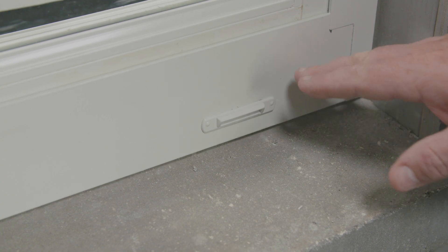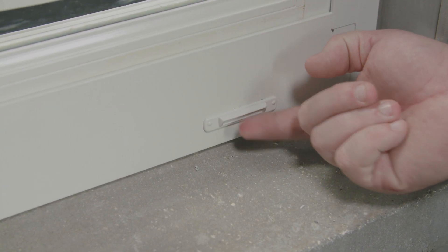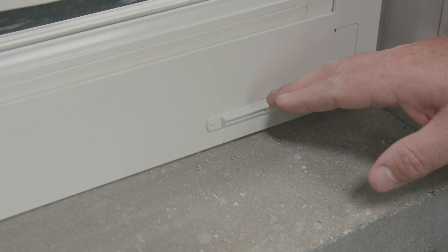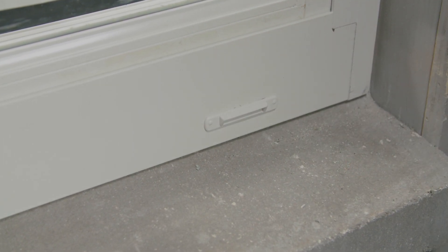The first service we're going to talk about is water not draining out of the sill. Look at your weep holes. The weep hole cover should be free and allowing the water to weep out of the weep holes. If there's stucco or sealant covering the weep holes, you need to remove the sealant or stucco in order for the window to drain correctly.